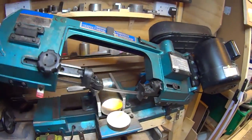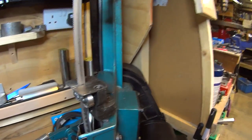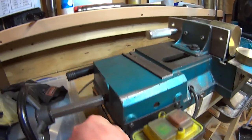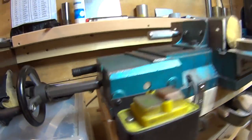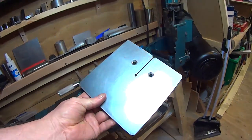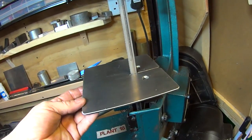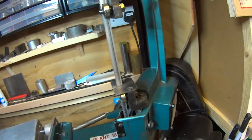The only other thing I've done: when you want to use the bandsaw in vertical mode, there's just that tiny little platform which isn't really much help. So I've made a larger replacement platform. You just take these screws out, swap it over, and it sits on top there — a nice bigger platform that gives you a bit more working space.